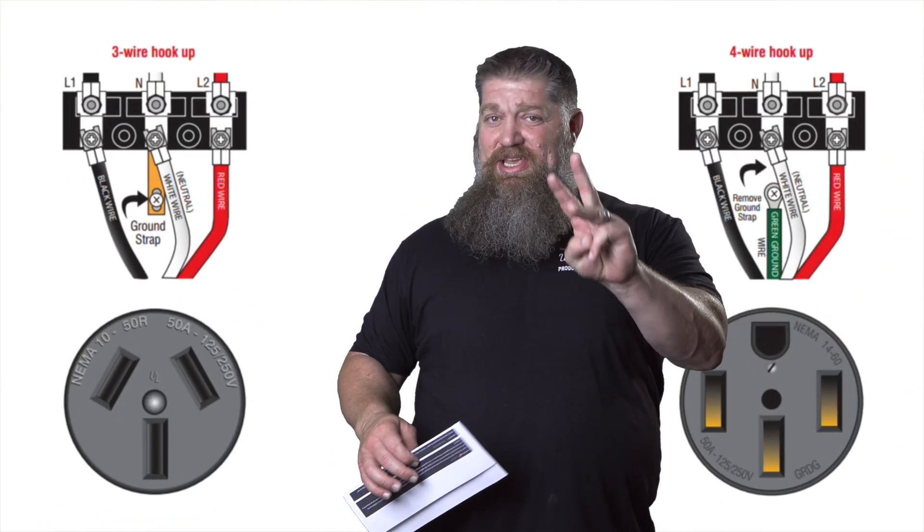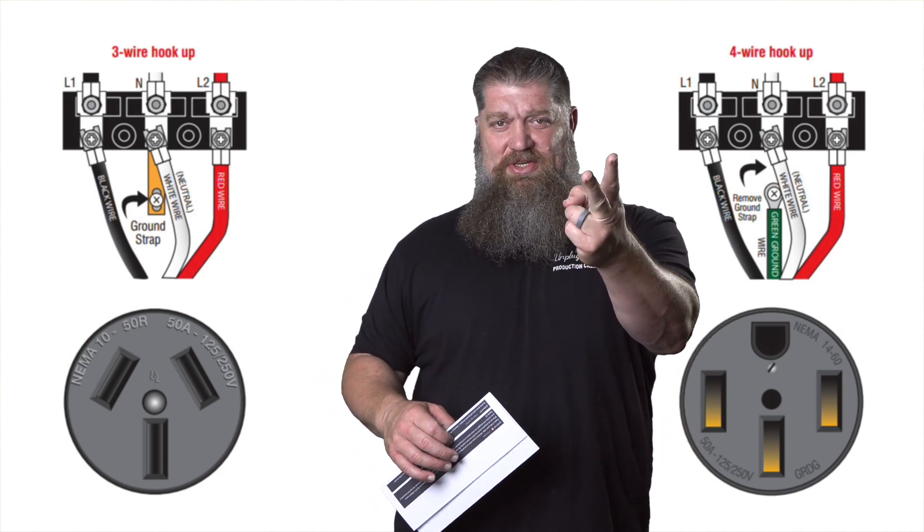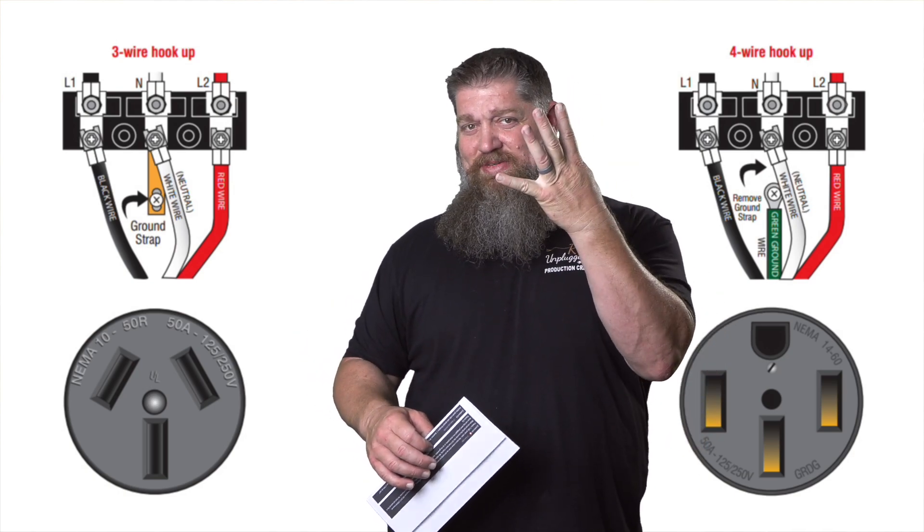By the way, if you take out the breaker panel box, more than likely your 12-volt connections are in there too, so all of those have to be listed, disconnected, and then reconnected with the proper fuses. There's going to be some plotting out involved. Also, the cable between the wall of your RV and your breaker panel box is set up for 30 amps, so that cable needs to be replaced with a six-gauge, three- or four-conductor cable — one for leg one, one for leg two, one for neutral, and one for ground.